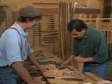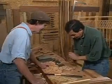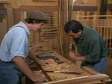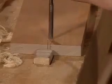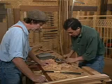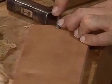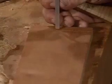dovetail. I'm sorry, reluctant to give up these chisels once they get into my hands. Yeah, so if it was me, obviously, this is no different than how you would do your Western dovetail, and I would gently set my line. Okay, so now you've got to turn it around and work in by hand. So there's your start. And then I would come in a little bit.